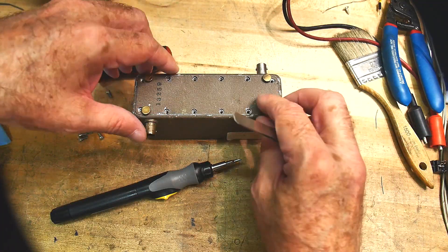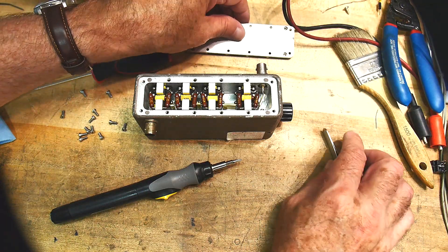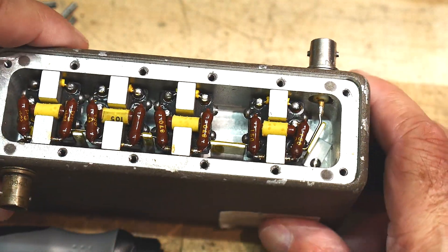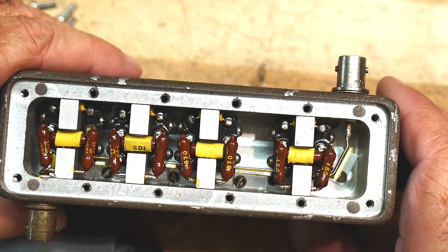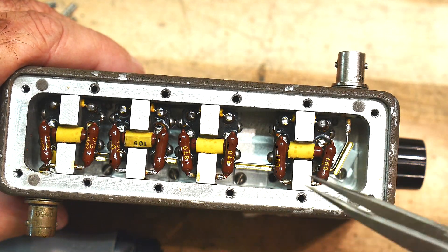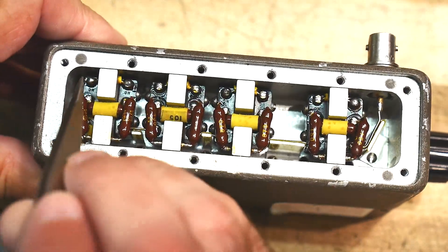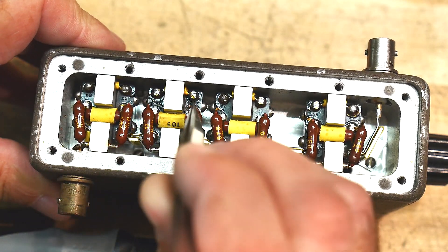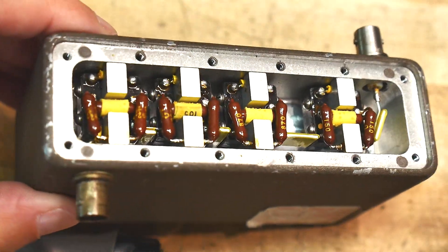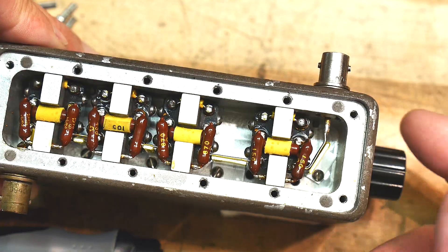Lots of screws! Let's see if we can take the bottom off — and there we go. Let's zoom in on that. So it only has to go to 500 megahertz, so you can get away with a lumped element. If you look in here, there are 1, 2, 3, 4, 5, 6, 7, 8 microswitches — those are little click-click microswitches — and we're clicking in and out different parts of the attenuator.